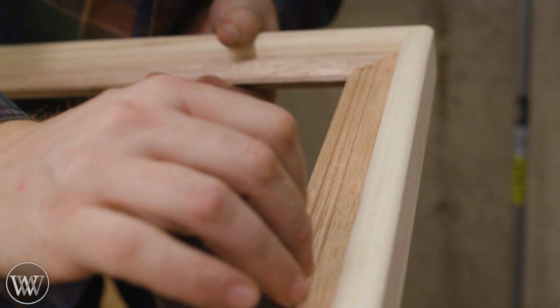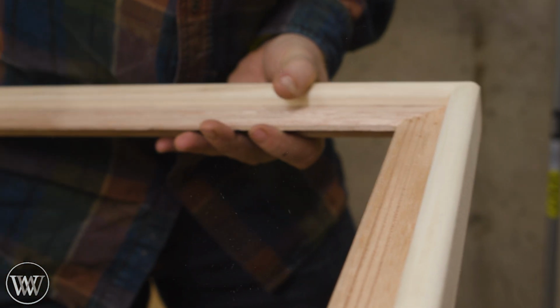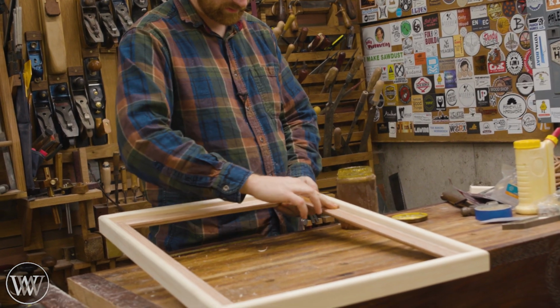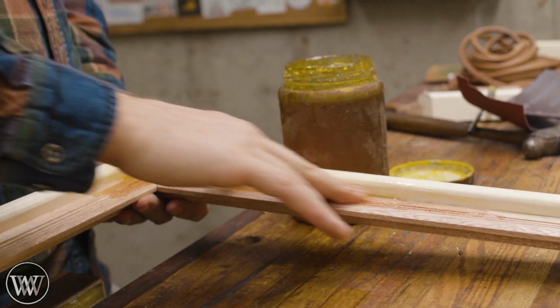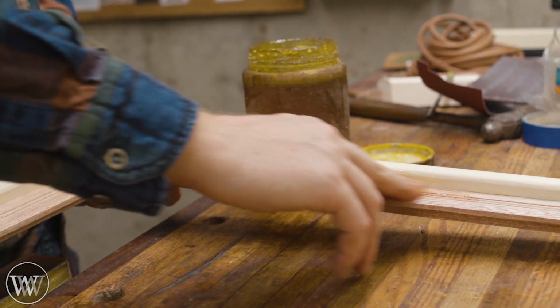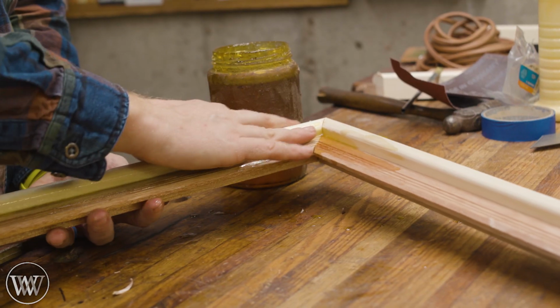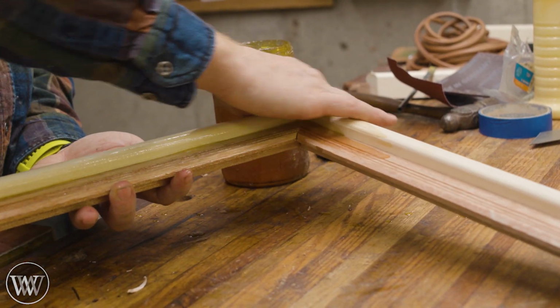Then I'm just going to do the last minute sanding on a few things with the alder, and then into those small grooves left from the beading plane, and we're ready for finish. I'm just putting on a boiled linseed oil and paste wax finish. There's really not any need for anything durable on this, so this actually worked pretty well.